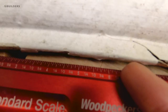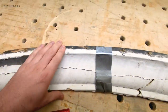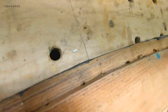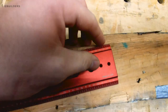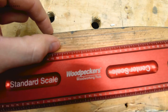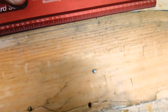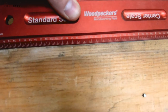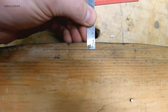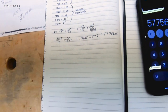So you're gonna wanna keep your two points of your straight edge touching a clean point, and then measure the middle here with your ruler — basically getting the height from here to here, which in this case is 5/16ths of an inch. And then we also want to measure the back just to double check that our pieces are correct. Due to this extra lip, I just went ahead and touched the edge of the ruler to both sides of my curve, drew a line, and then measured back from my line to the edge — also giving me about 5/16ths. So from there I can just bring it over here, run my formula, and come up with my radius.